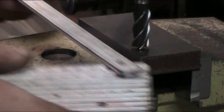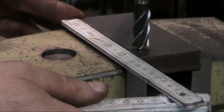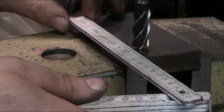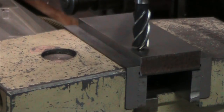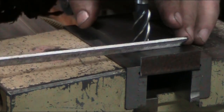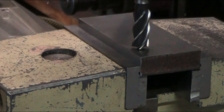We've got about 117 millimeters here to play with. So then we'll space these about 30 millimeters apart, that will be plenty, and about 20 or 30 over this way, I think we can go, or yeah, 30 over this way. So yeah, a 30 by 30 spacing.